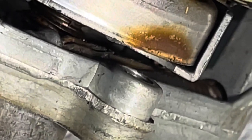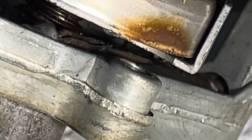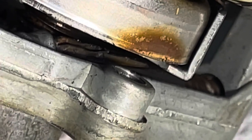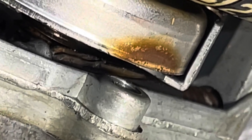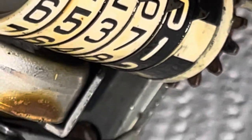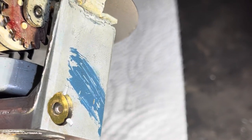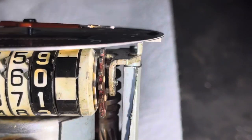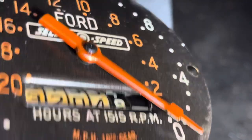The whole body is all cast — either aluminum or zamak. Since it's King Sealy it might be zamak, since they used that for all the gears in the old Craftsman stuff. The opposite end is pressed in with a little brass washer, and the sides are peened in to hold it in place. To disassemble this, everything is pressed together — you might as well be looking for a watchmaker to get this apart.